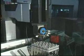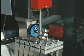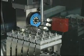It is equipped with an automatic electrode changer, which supplies 18 to 54 electrode tubes. It also has an automatic guide changer, which can be programmed to use 5 different guides for different sizes of electrode in a program.